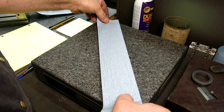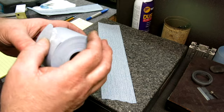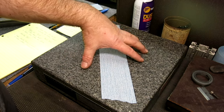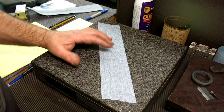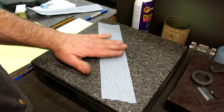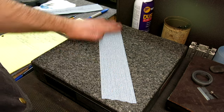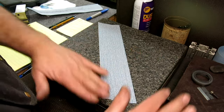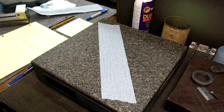Pull a piece off the roll and stick it down. Make sure your plate's clean underneath. And this is not healthy for your surface plate, let me tell you that right out of the gate. This is the one that when I get it calibrated and relapped, it takes a lot of work, because granite will wear. What makes it wear is the abrasive gets under the paper and you're shifting around on it. If you stick it down, the abrasive stays loose on top and you can brush it off.